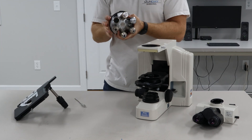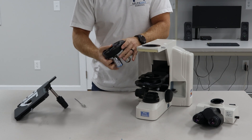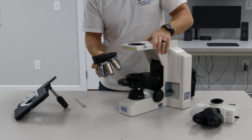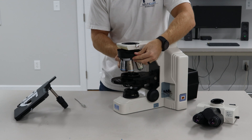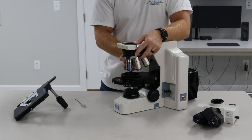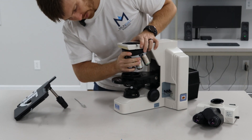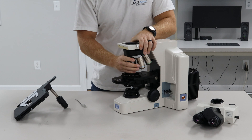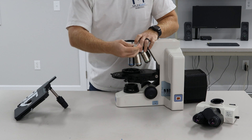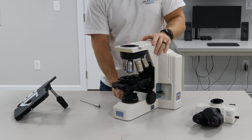Then we're going to take the nose piece. The nose piece, like I said, is very tricky. It has a groove here. It's best to do it with the stage off and the condenser and substage down. You want to kind of set it halfway back so the notches go in. It's very, very tricky. Once you get it in, never take your hands off of it until you know it's in there, then tighten the Allen screw. The nose piece should be on there really good and tight.